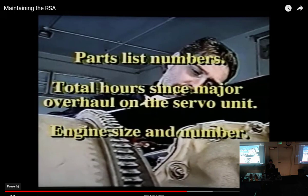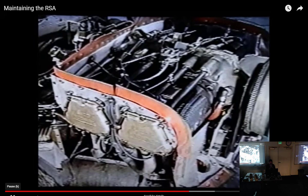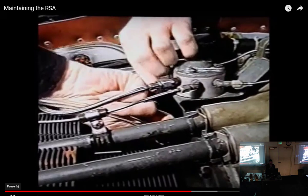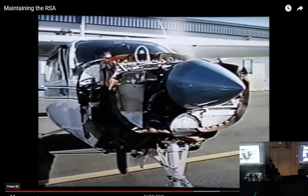I think there's air in my fuel system. What's going on? So, you think there might be air in your fuel system. Okay, let's take a look. First, take a 12 to 14 inch length of clear Teflon tubing and connect it between the servo unit fuel line and flow divider. This tubing should be clamped between two AN style fittings. Now, start and run your engine and watch for air bubbles. It's very important that you not run your engine, by the way, without the cowling for sustained periods of time, as engine damage might occur.